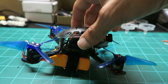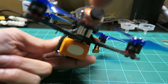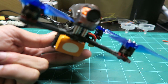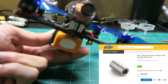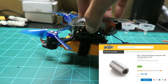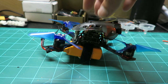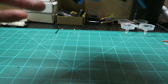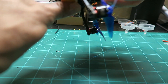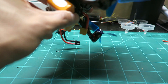So to start off with, as you see right there — see those little spacers? Those are 10mm by 5mm spacers, they're the M3 size and they're non-threaded. I got those from GetFPV.com. I got a pack of them, there's 10 in the pack, but you're going to need 5 of them for the Babyhawk R 3-inch. You'll need 2 on the back right there and then 3 up front.